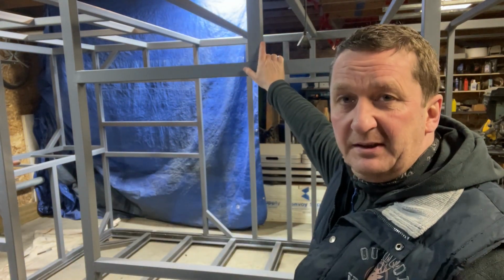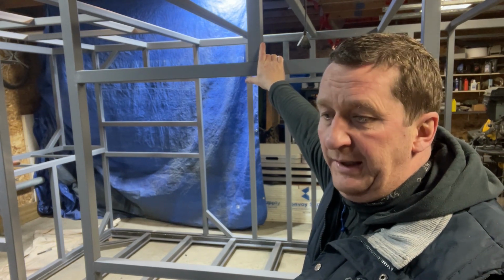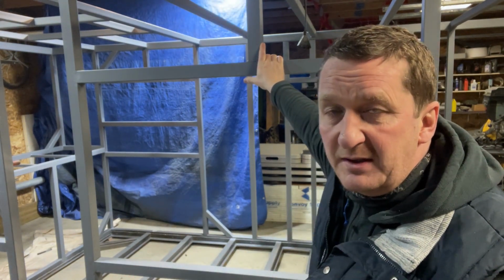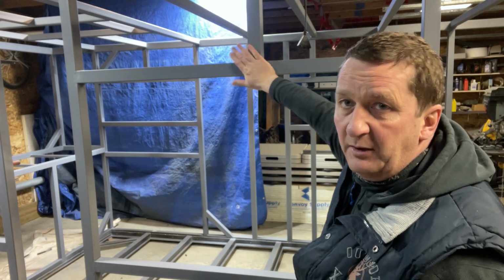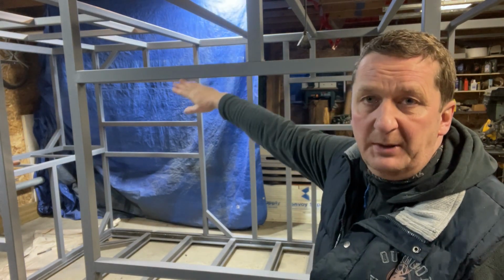And just imagine you leave it like that and then put your aluminum sheets on it, and then somewhere the sheets fall off while you're sitting inside. So this is why I sanded all profiles before I painted them with the primer. And even later, when I apply the activator and the primer for the Sika glue, which is maybe in the next video because I'm still waiting on those deliveries, I will sand this outer surface. Not on the inside, because I'm not gluing anything there, but on the outer surface where I'm gluing the panels against it. I won't sand down to the bare metal, but I will roughen the surface of the primer, for sure.